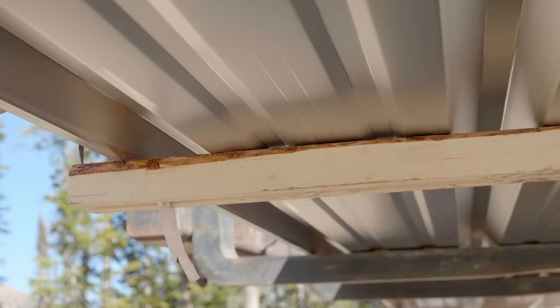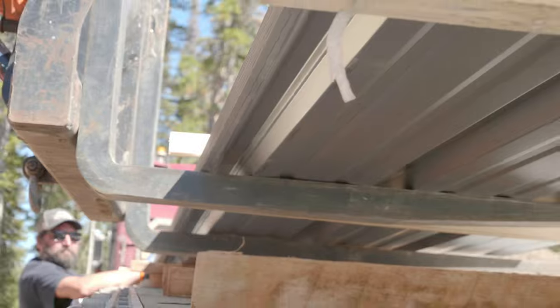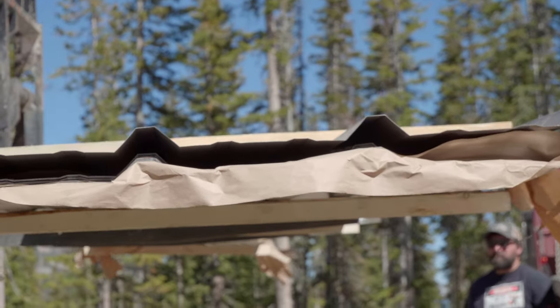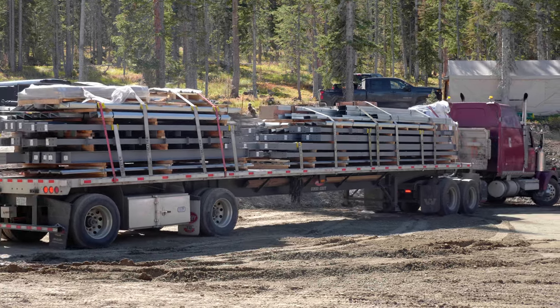This building is kind of unique. Besides the snow load and the location, the panels come through a new supplier — we're actually able to get cold-rolled panels. These are used in what we call a Telluride roof — rusted panels that rust out and look vintage. These are 24-gauge panels, but instead of standard corrugated panel, we ran them through the roll former in our profile and did cocoa brown trim to match. All the screws are cocoa brown, so they'll match when it rusts out. It's going to be a really fun project and hopefully one of the more useful instructional video series for anybody.